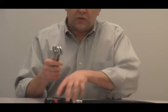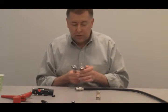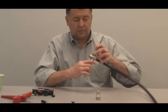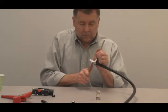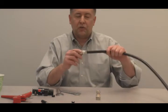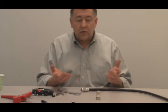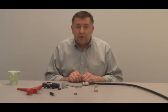At this point you've turned the connector onto the cable. All you have to do is tighten it up. We have 15/16-inch flat wrenches, which is our 3190-1435, which you can use to tighten that up. You don't have to worry about over-tightening this connector — just snug it up until those sections bottom out. You can also use simple adjustable wrenches. Thanks a lot.